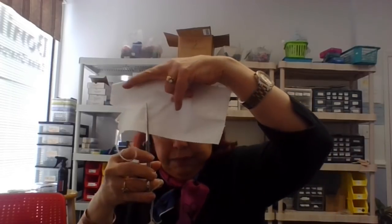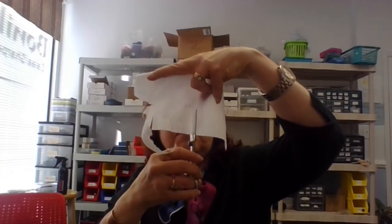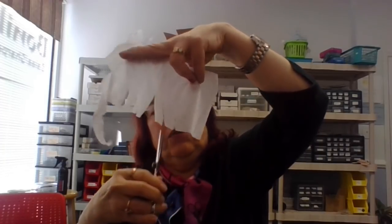Now, sometimes they're just a little bit out of alignment, and I can give you an example of this one. This one will cut, and let me get some tissue here. This will cut dry okay. No, not too okay. The tip cuts, if you have a tip cutter. This is another example. See, it'll cut dry okay. It feels a little crunchy. But if I were to wet the tissue, and I'll hold it up, that doesn't cut well at all, as you see. And look at this one. It's not cutting well either.